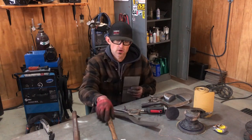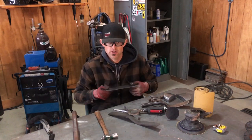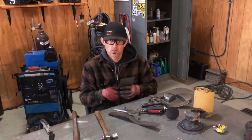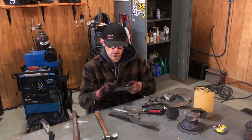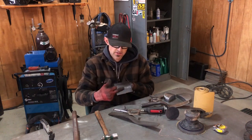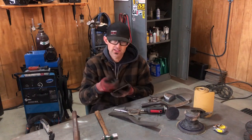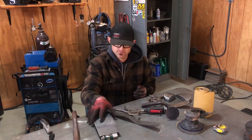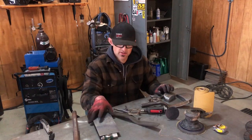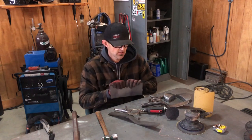The next video will obviously be without these tools, and basically right after I weld it, you go over to the planishing hammer and you just keep working it until you get it where you want it and you're blending out. And see, so with this up, you could feel it a little bit. I need to come out here and stretch a little bit, but the English wheel will take care of that, and I will blend these two together. So hope this works for you guys, and now you guys can see the whole process of what planishing is.